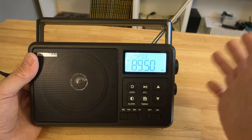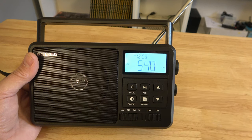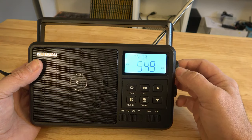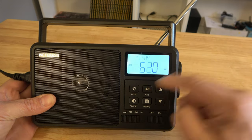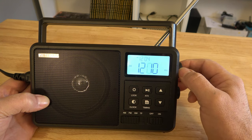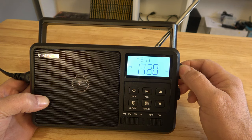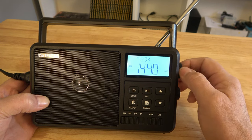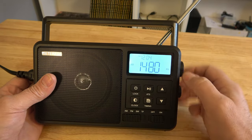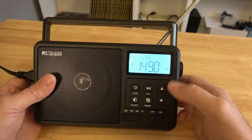Let's switch over to AM. I don't get a ton of AM stations but it's worth a shot. You can hear that interference — that noise. I have a cell tower across the way and I recently filed a complaint with the FCC. Something on that mountaintop is causing that kind of issue. Rolling through — you can scan as well. Sometimes 1210, let's try 1290, 1450 — our other local station about 30-40 miles away at 1450. Not a strong receiver on AM, and that tower interference is partially to blame.